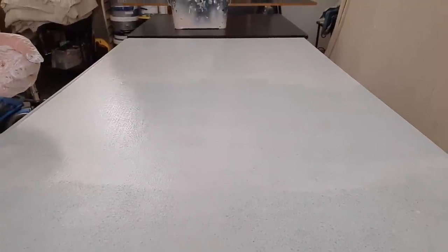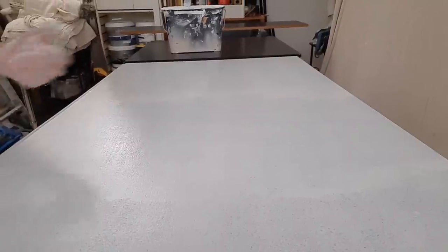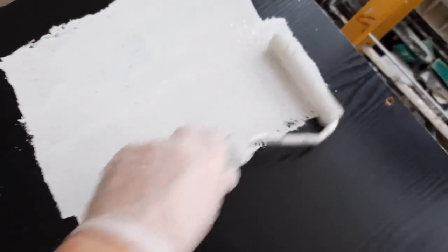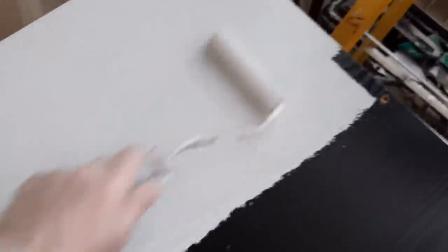It's getting two coats of top coat. I'm using the Zinsser All Coat Gloss on this. I've got some white and I'm going to mix black into it again and use that — because it's tough stuff. You can actually see the difference between the colour — it is grey. Difficult stuff to use, it dries so fast — it's unbelievable. It's literally just a matter of getting it spread out, and as you're spreading it out you're trying to lay it off at the same time, because it dries that quick. Once you've done a bit, don't go back over it.